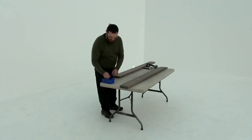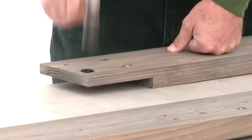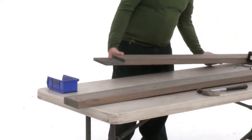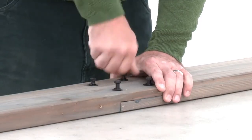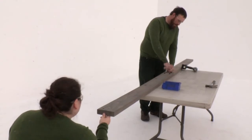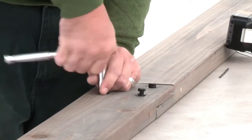Working on a flat, solid and raised surface, insert T-nuts into the four holes on one end of a front beam. Flip it over and place a second front beam on top so that the cutouts interlock. Attach loosely with four hex bolts. Have a second person check the alignment of the boards from one end. When the boards are straight, tighten the bolts.